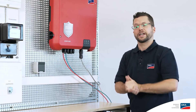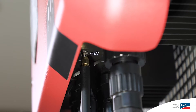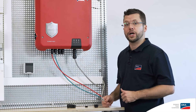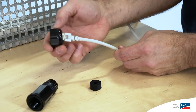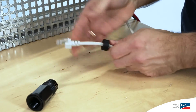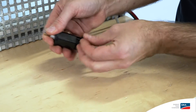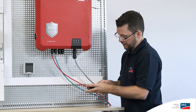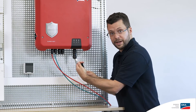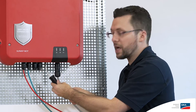This ensures that the device is sealed properly. The easiest way to establish a communication option with the inverter is to unscrew the red cap and then screw on the WLAN antenna supplied. To connect the inverter to the energy meter or Sunny Portal using an Ethernet cable, it's important to first equip the Ethernet cable with a swivel nut, then attach the rubber sealing ring, and then place the threaded sleeve over the Ethernet cable. It's best to fit the rubber seal at the end of the threaded sleeve. Now we can insert the Ethernet cable directly into the Ethernet jack on the inverter. Next, slide on and tighten the threaded sleeve.